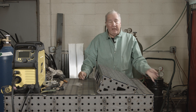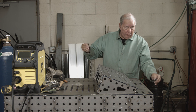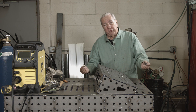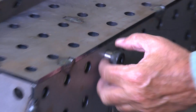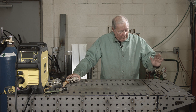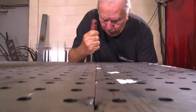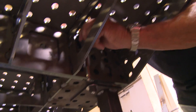Our welding is finished — now all that remains is to attach it to the table. The kit comes with a bolt, a big heavy washer, and a nut. I'm choosing to go through the fourth hole down. You can either do the second or the fourth depending on the clearances you have underneath — I'm choosing the fourth because I have better access when I go to tighten it. It's a shoulder bolt, so part of it sticks out and hooks into the slot and drops right down. We've got our table welded and mounted. The only thing left is to tighten up the bolts, which will pull it in tight. We've got a nice little one-foot extension on our table — a lot more workspace and a fun little welding project.